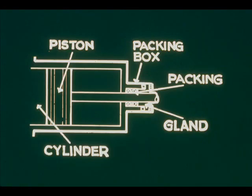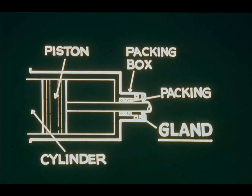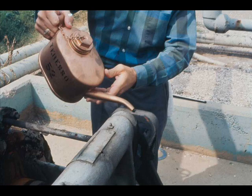A rod to each liquid piston goes through a packing box or stuffing box. Packing prevents excessive leakage of liquid, though some leakage must be allowed to lubricate the packing. An adjustable gland holds packing in place and can be tightened to stop leaks, but must not be so tight as to produce excessive friction. The liquid being pumped provides lubrication for internal liquid end parts. Automatic lubricators, grease or oil fittings, and manual lubrication take care of external moving parts.